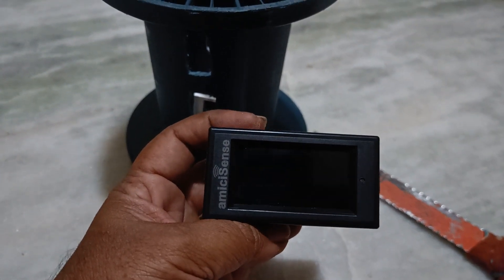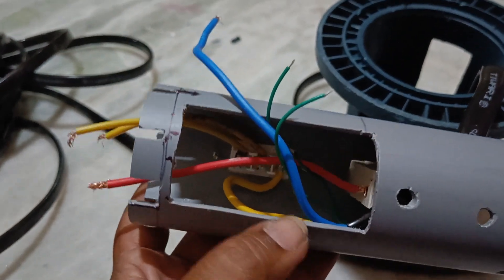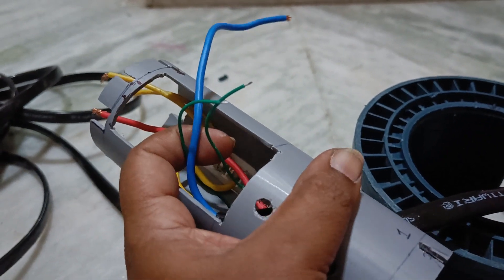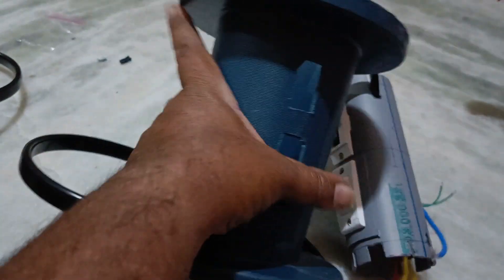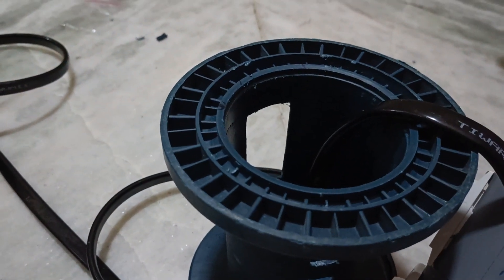We will use a power meter also so that we can understand how much power we are consuming. The hole for the power meter is now cut. The power meter comes with a CT transformer, so I kept the CT transformer here — the leads of the CT transformer are these green ones which will go into the power meter. The cable is pulled from one side and this is where the power meter window will be, and this is the window for the trip switch and earthing control switch.